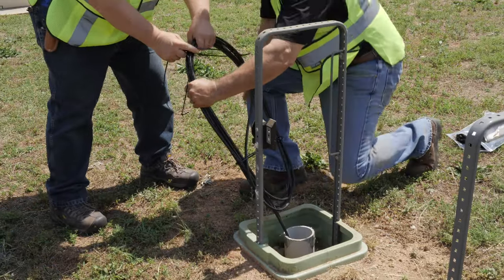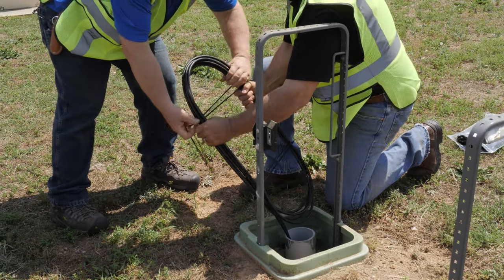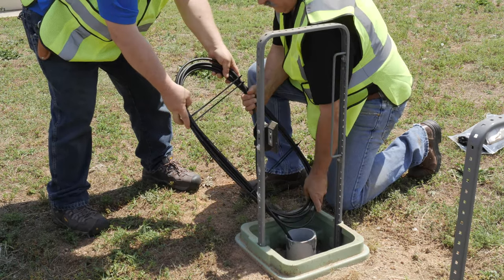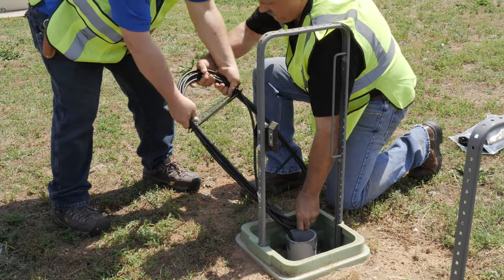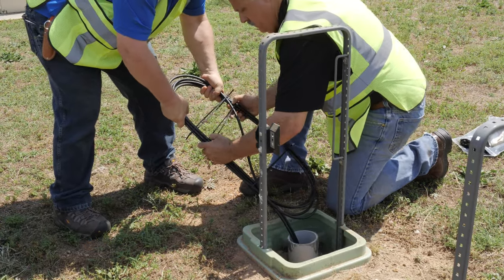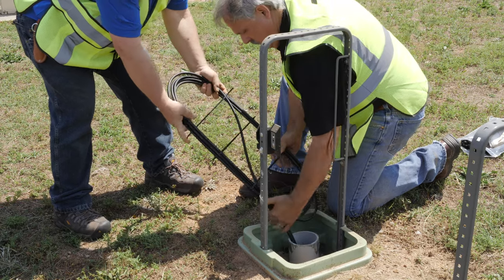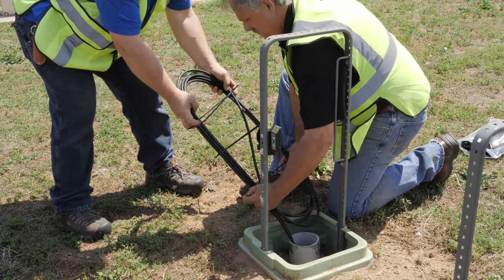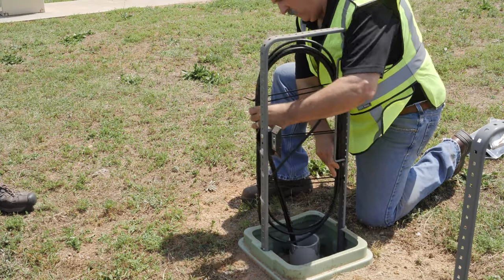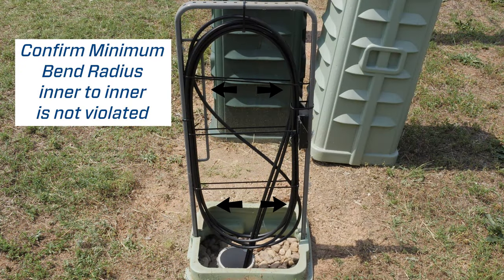This will have to be adjusted at the pedestal when attaching the coil. It can be adjusted by increasing or decreasing the coil diameter, adjusting the height of the oblong coil, and by pushing or pulling slack from the duct. This must look like the reference image with the teardrop centered at one end and the S of the coil running vertically in the pedestal.